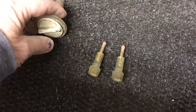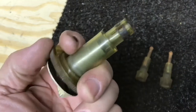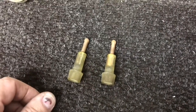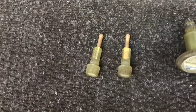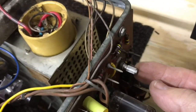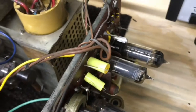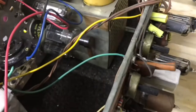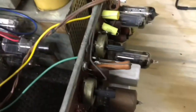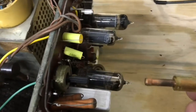I'm going to look at these knobs and explain how they work. This is just the channel selector fine-tuning — it's the correct length that goes down through the top of the cabinet. These two knobs are the contrast and the volume. It sets kind of strange in a way — the on/off switch is also the brightness control. It's just this one control that turns the set on and off but also controls the brightness, so that's a knob in itself. The other two are contrast and volume.